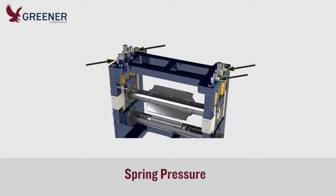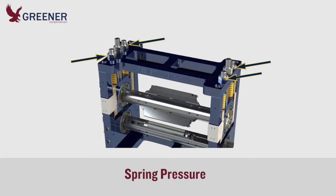Adjusting spring pressure doesn't change this gap. Spring pressure provides the resistance and tension applied to the jaw serrations to create the seal and the force for the knife to cut against the anvil.